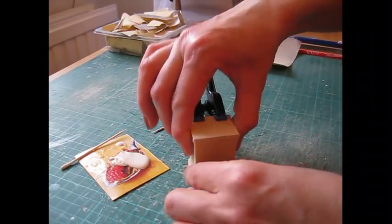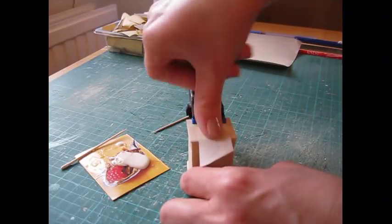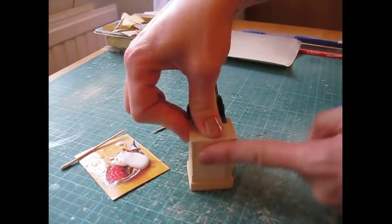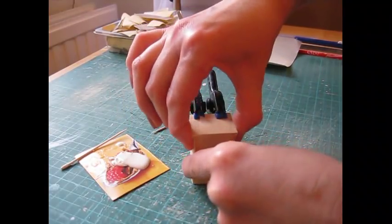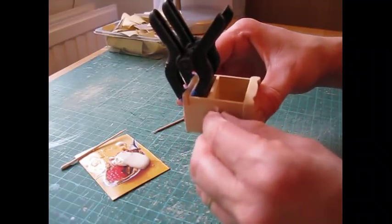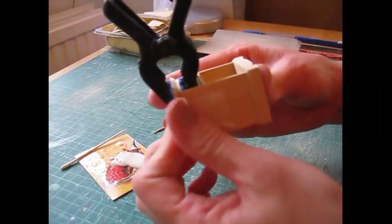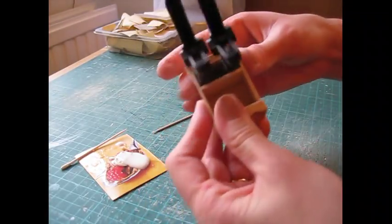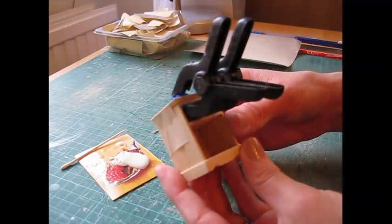Hold the top in place with a piece of masking tape along the back edge, pulling it nice and tight. Use clamps along the front edge to avoid a gap along the top once the glue has dried. Check from the side that any excess glue is removed. Put an extra piece of masking tape over the back to hold it down, pulling it tightly — wood tends to try and curl upwards when drying, so it's always important to secure pieces together. Leave to dry.